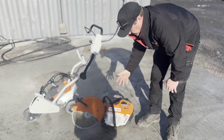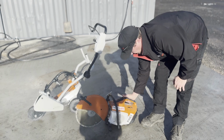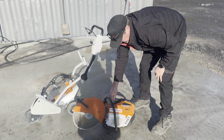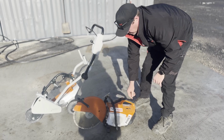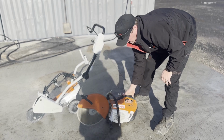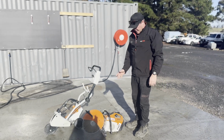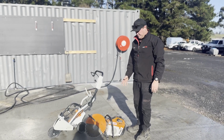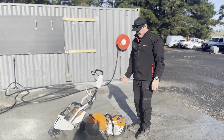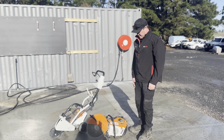So then once you've done that, it should be warm enough all day that you don't need to use the choke again. You should be able to just start it. It might not be warm enough yet. Just put it on start and hit your decompression and start it without your choke. So yeah, when it's cold, use your choke. Once it's been run, don't use your choke. If you keep using your choke, you'll flood it. You won't get it started, and then we'll get phone calls all weekend like we do saying this thing doesn't run, when it clearly does.